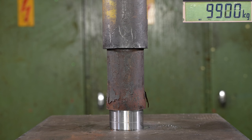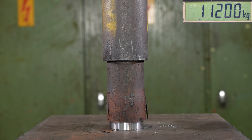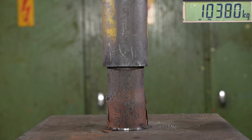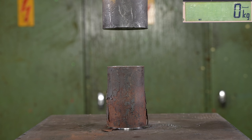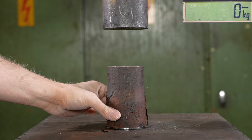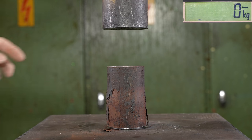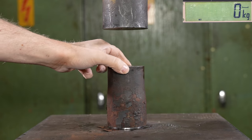Oh, that's a huge difference — it's less coarse. The lubrication really makes the difference — much easier. I would say the temperature is also pretty similar, which makes sense because we did a similar amount of work. And now you can see that the material is flaking away — it's not ripping at all.